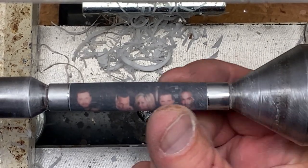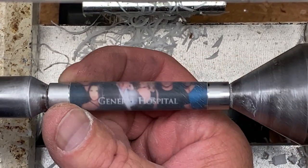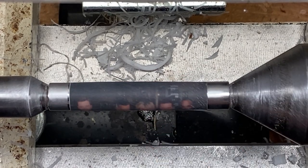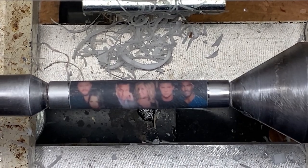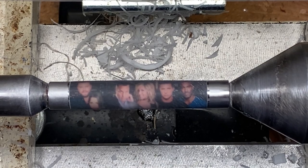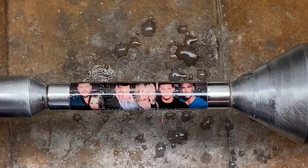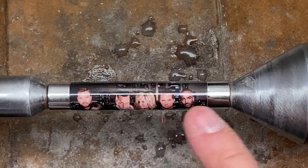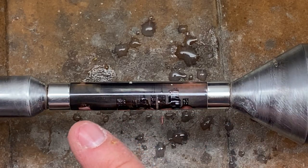Very little scratching, and the micro mesh pads can polish it up and make it look absolutely incredible. Just like that the blank is sanded from end to end. I kept feeling it between grits and I don't feel any tool marks along the blank. There are a couple of scratches you can see but they will disappear with the micro mesh pads. I'm going to run through all nine pads, 20 seconds per pad. The pads will be dampened with water and we'll wipe the slurry off between pads. After micro meshing, I'm watching the reflection of the light above my lathe — that shows me any defects — and from end to end it is perfect, zero defects.